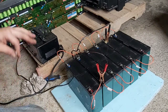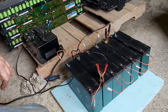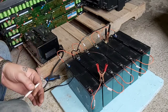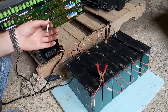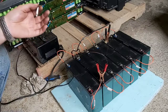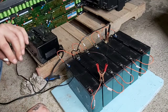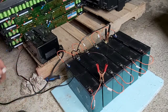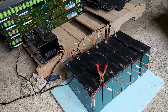There's a pretty good possibility these batteries aren't going to come back to life. I'll pretty much have to make some kind of a battery for this no matter what. If I'm going to make a 96-volt battery I might as well start with that instead of making a 72-volt and then a 96-volt battery in the future, just to ride it for a month before it snows. I'll just let this charger go for a while and see what we can get out of it.